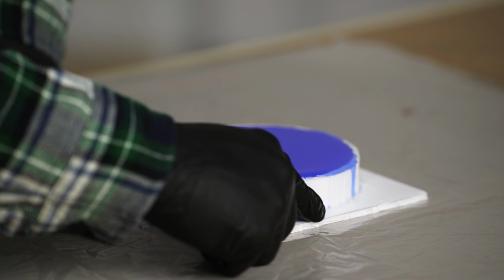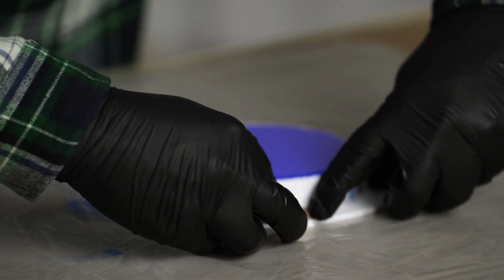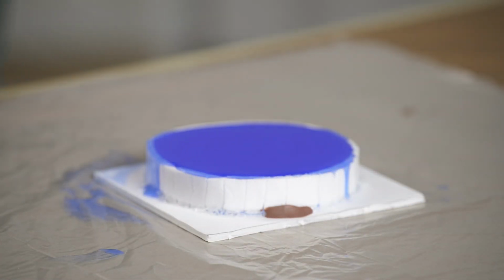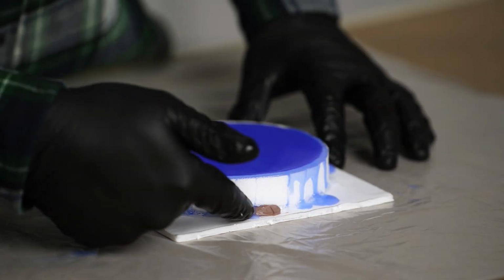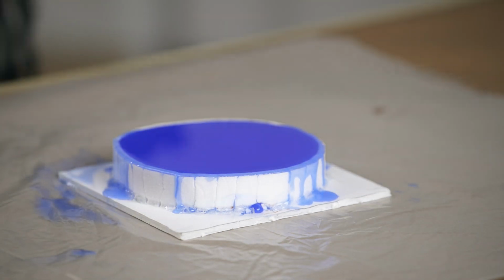Although the clay won't stop the leak, it may buy us some time. Using hot glue won't work, since the melted glue won't have time to harden before the silicone pushes it out of the way. With the time we've bought, we can decide what to do. The key factor in that decision is going to be the open time of our silicone.